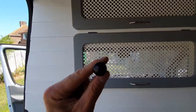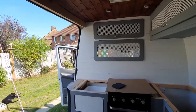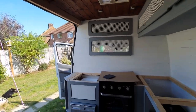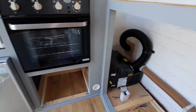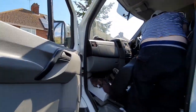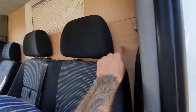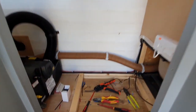Ben's arrived and he's going to give me a hand to drill the hole in the floor and put this temperature sensor in. After a detailed conversation we've decided to put the sensor up here - it's high up, out of the way, and it's close to the door at the cold spot, as Ben mentioned. To do that we're going to run this cable, which just plugs into the combi boiler down there, around the back with these cables. I'll get the cooker out again and run it up the wall behind and then into the wall there. Ben's taking the seat out because we're going to take this bit of ply off, get the cable in, and fish it up the wall.